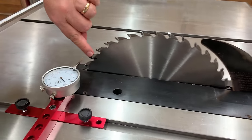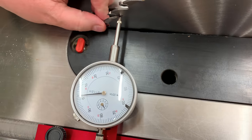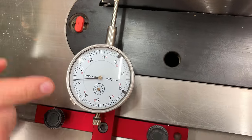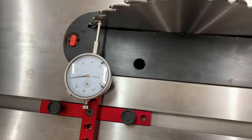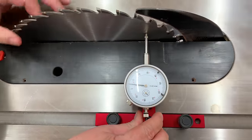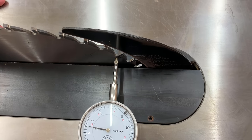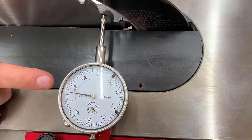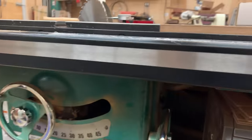Now that it's all set, I've made a little X mark on my blade. I want to use this same spot to check the dial indicator on both sides — the close side and the far side — so I'll rotate the blade around and use that same mark. This eliminates any potential error from having a warped blade. I've reset the dial indicator to zero and I'm moving it forward to check the other side, coming right up to my same little X. It looks like I'm five and a half thousandths out of perfect — out quite a bit, but it's pretty easy to fix.